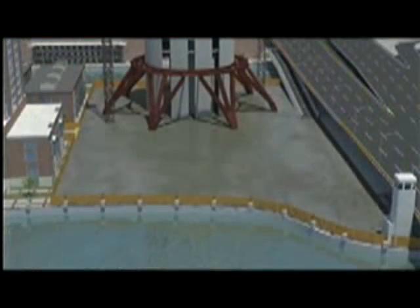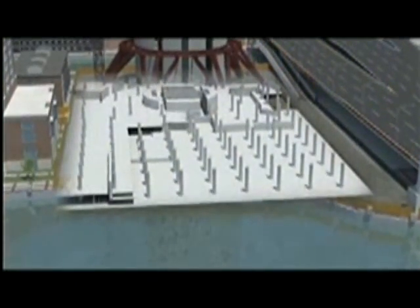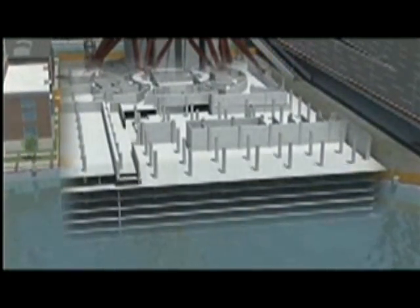Normally it would be the last thing coming out of a car park. We're going to put that in, and then we're going to go down below that level and mine out the level below that to create a level surface. We'll pour another slab, then we'll go down below that one and mine it out. We'll keep doing that for seven levels until we get all the way to the bottom, and then we will pour a slab and we'll be done.